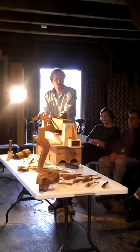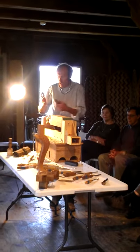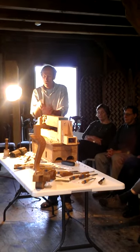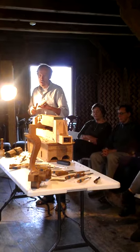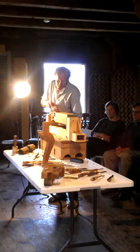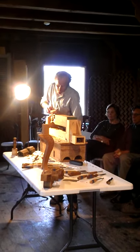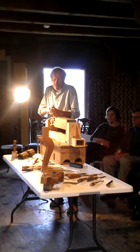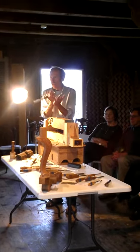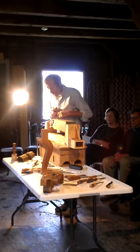I'm always anchoring my hands on the work. You can't carve like this any more than you sign your name without anchoring. You always have to have your hands anchored on the work because with carving, it's gas and brake at the same time. I'm holding the tool back with this hand and pushing with this hand — it's like this all the time. If I want to let my tool go to a certain spot, I put a lot of pressure on it and just release this hand enough so it passes through. You'll see woodworkers have calluses on their hands, elbows, and forearms from all this leaning. That's how you get the control you need.